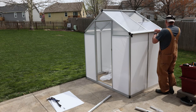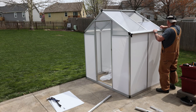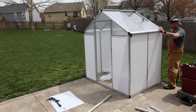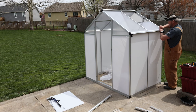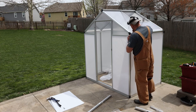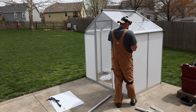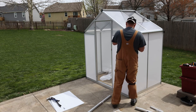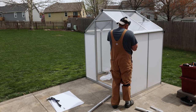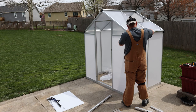It's slightly better. I probably could have taken a little bit more off because that screw in there still interferes. I was able to push it and this one goes in, but I don't think we'll be able to get it to do the same on this side. No way. An option would be to cut a little notch in 33B here so that the screw rests in there. I might be able to do that still later. I'm not gonna do it now.